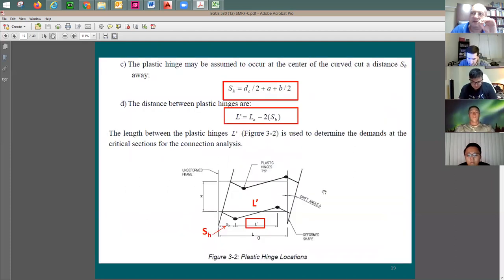After making your choice, you need to figure out the mechanism shear, which is similar to the mechanism force discussed for moment frames. To find the mechanism shear, you need the distance from the center of the plastic hinge to the center of the plastic hinge on the other side. L_0 is the distance from center of column to center of column. L-prime equals L_0 minus two times s_h, where s_h is measured to the center of the column.